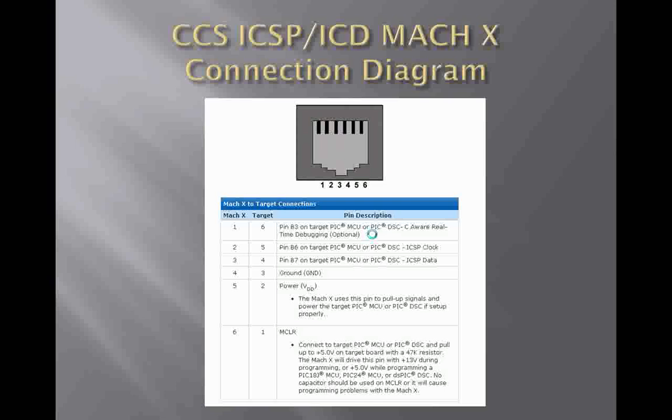Basically, per the connection diagram shown, you hook up pins one through six and connect them to your ICSP pins — B6 and B7, which are the clock and data lines — then tie your MCLR in. As discussed in the previous Blink project lesson, the MCLR pin can be used as a reset function to software-reset the chip. That's basically what ICSP does: it software-resets the chip and then loads the program to it once it wakes back up. Fairly straightforward and very easy.